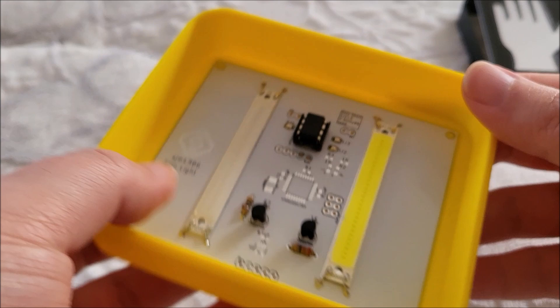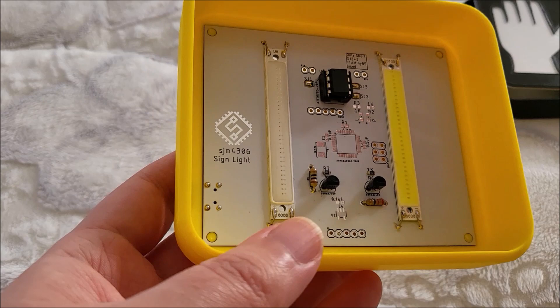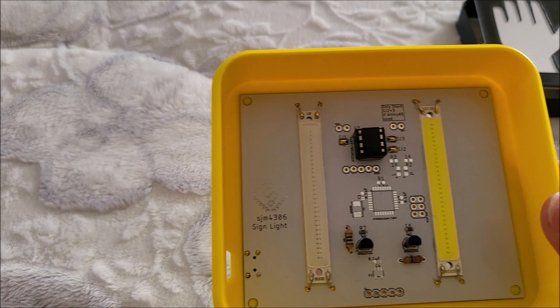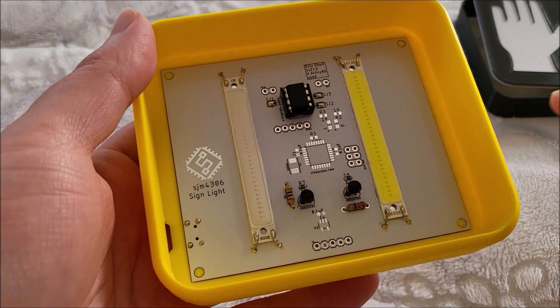I probably won't be able to get this out now that I think about it the way it's designed. If I wanted to, I probably should have put a little finger hole or a little gap so you can get a tool in there to pry it away. Basically this PCB holds the main controller. There's nothing on the back side. There is a bodge wire because I forgot to connect the USB ground to ground - I know it's a beginner mistake - but I had to put one bodge wire. I'll fix the files on that so it won't be an issue. I wanted to make this board as flexible as possible. There is a little tiny gap behind this board, so you could fit a little bit of circuitry or maybe a thin battery if you really wanted to make it battery powered fully internally.